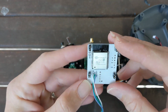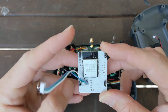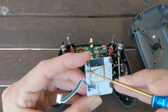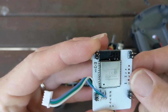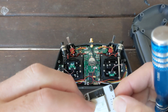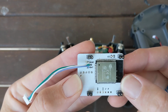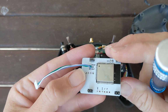And that's it. So this is just a rehash of our standard design we have for all of our ESP modules. We've got our ESP here. We have a 10K resistor for the enable. You can barely see mine because I use a 0402 component, but you can use a much larger resistor. Your external module wires, so we have S-Port, ground and VBAT. I've reused the headers from the internal module.